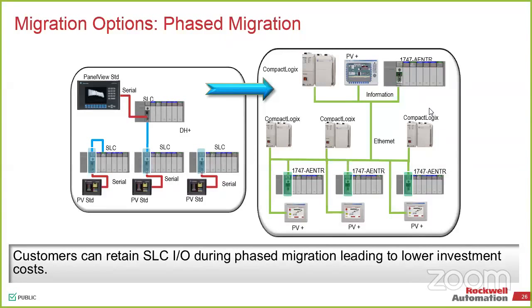So what we would do in those instances is, just because the infrastructure might be CompactLogix doesn't necessarily mean you can't do a little 4-slot ControlLogix with nothing but an adapter and your DH+ card. We've done that before. We may have to go that route in instances where the customer says the requirement is you cannot use anything like this or that. Granted, I'll probably have some words for them and try to convince them otherwise, but in instances like that, we are able to get around it. It's the same idea as the L7 to the L8 platforms. Just because I say we can't support redundancy on the L8 doesn't mean we can't use an L8 infrastructure built around an L7 ControlLogix from the family. So we can still do redundancy there, but have one aspect where it's an L8 with new I/O. We're able to mix and match with these types of networks, so that might be an option.